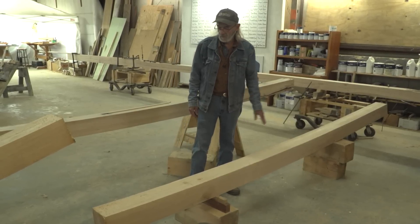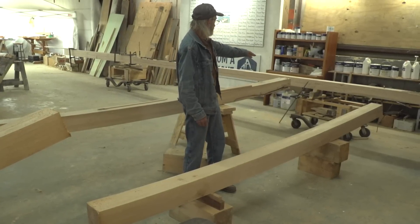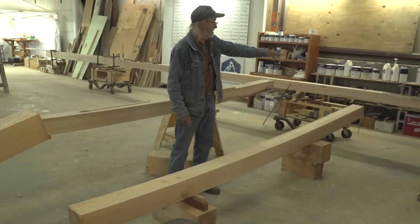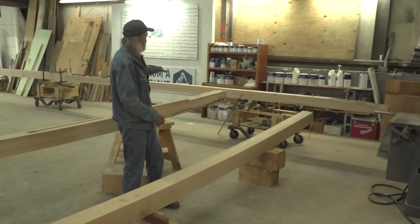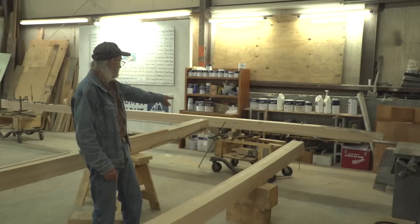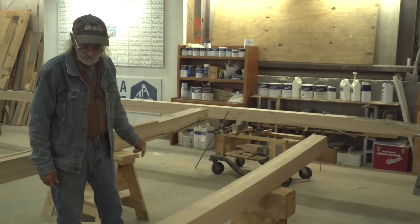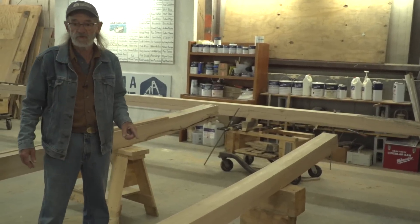There's the piece for our forefoot right there, and we're going to arrange it so one end sits on that mobile horse right there and the other end will sit on a saw horse. After we saw this scarf, we're going to roll it on its side. It's got six inches between that timber and that. We're going to move this over and slide it down a little bit — just a temporary position.